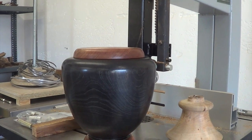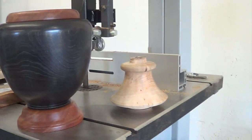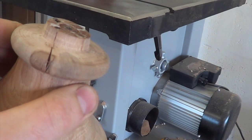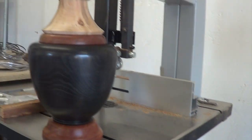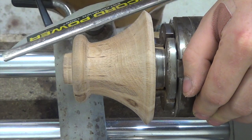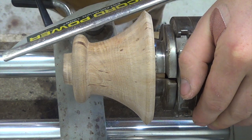I've decided I'm going to glue the rim onto the top of the urn, so I'll glue these three pieces together now. While that's curing I can work on ebonising the lid. It has cracked however — it's obviously dried a little bit. So I'm going to reshape this and make it a bit smaller so it looks better on top of the urn. First thing I'll do is turn away the wood until the crack disappears, and then I'll be able to see what I have left and reshape it to fit nicely on top of the urn. I'm going to remove this sharp edge as well and have that more rounded to match the bead on top of the urn.